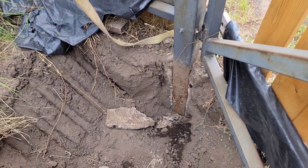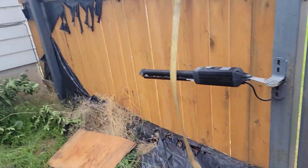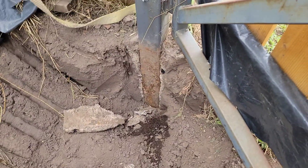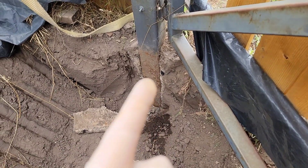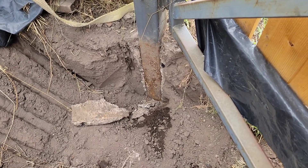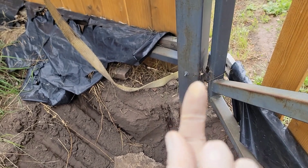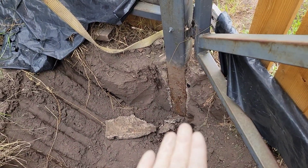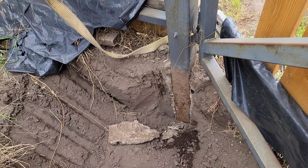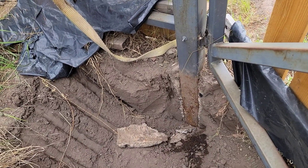A couple updates. My fence was actually starting to sink. I built this a while ago with metal posts buried in the ground and we got pretty deep burying it. But I didn't put any rebar or anything welded to keep it from falling, so it actually sunk into the concrete pillar that I built there. I'm going to raise it up either with a floor jack or pull up on it with the Mini X, and then put something under it like a piece of concrete to keep it from sinking.